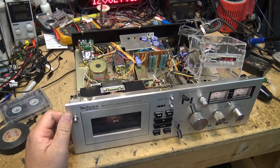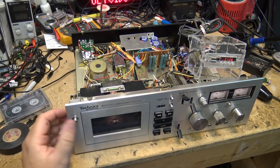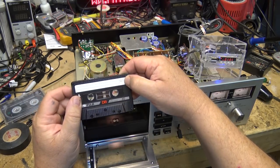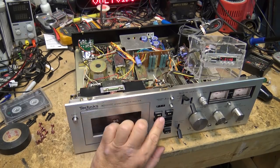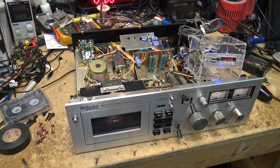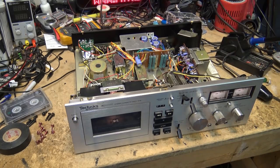It sounds good. It's a standard tape, so if I were to record on a ferrochrome or high-bias tape it would obviously sound better than this regular cheap iron oxide tape. This is just a Fuji DR normal position — for that it's sounding fine, no complaints. Remember this was 1976. Cassette decks really got into their prime when metal tape was developed, when Dolby C was developed, when Dolby S was developed — that's when cassette deck quality really took off. But this thing sounds good.